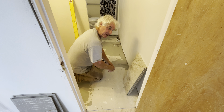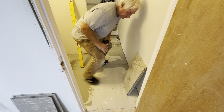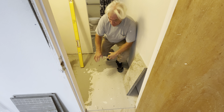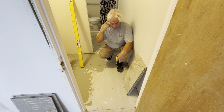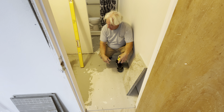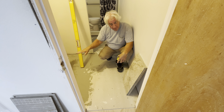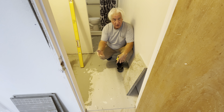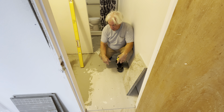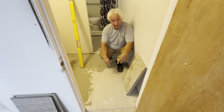This entire area right here is the high spot. Over here, this is only 51 and a half inches or thereabouts wide, the bathroom. This is a little bit lower. So what you can do is you can float it up a little bit, use a couple of nickels, some hardybacker to get your level, and then go from there or pack underneath the stone.